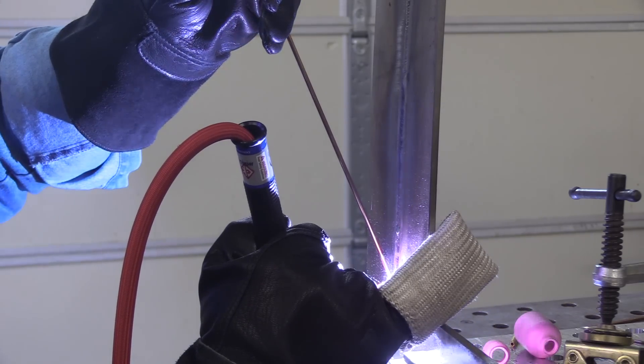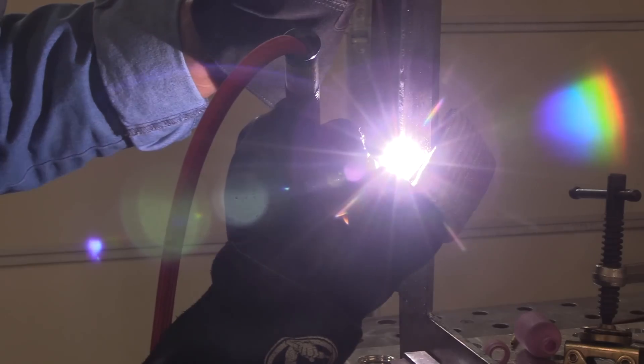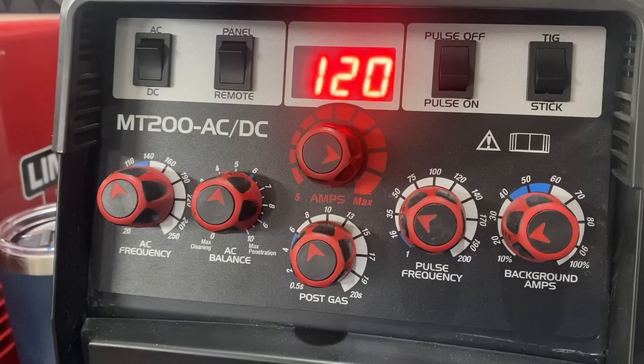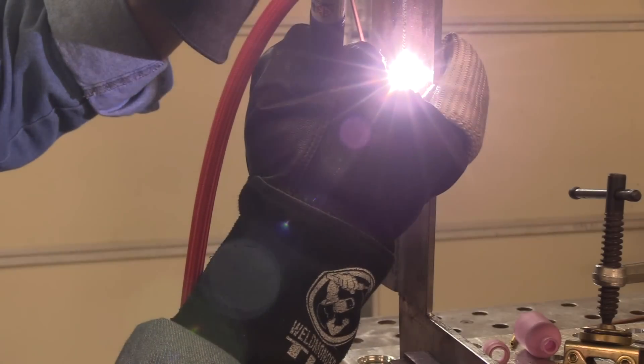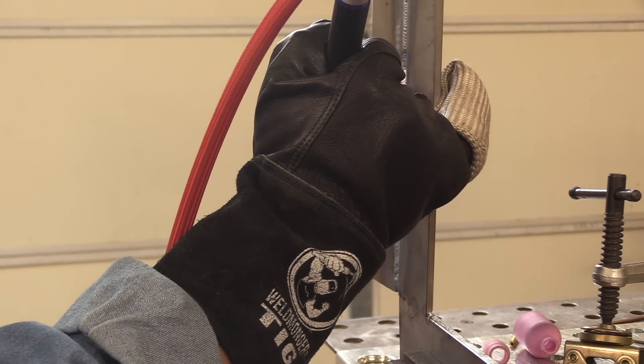That's about right — always room for improvement. Now let's do the third and final pass with the tig finger freehanding. For some reason I'm usually able to carry just a little bit more metal when I freehand than when I walk the cup. I guess it has something to do with the freedom to move where I want instead of where the cup walks me. This one pass is going to do the job — so the freehand will get done in three passes total and walking the cup took four. Still at 120 amps, keeping a little bit of pressure on that filler rod. I'm taking a little bit bigger steps, increasing travel speed, propping right on that hot metal with the tig finger — hanging in there as long as I want, working like it's supposed to.